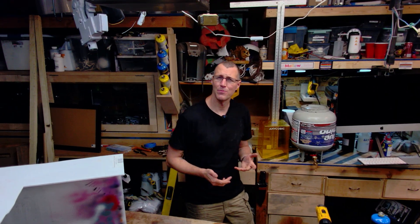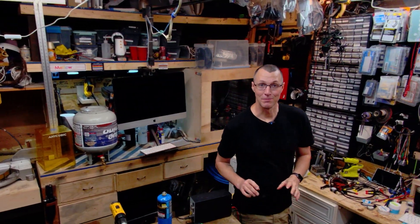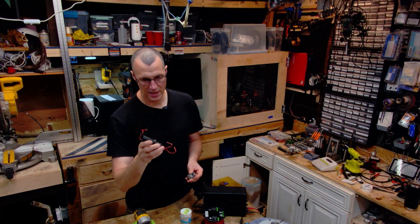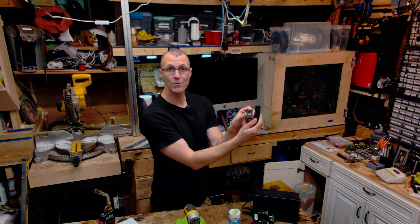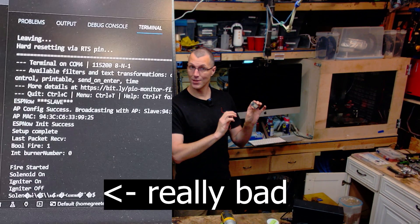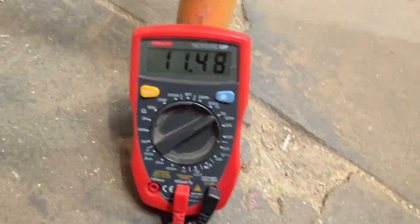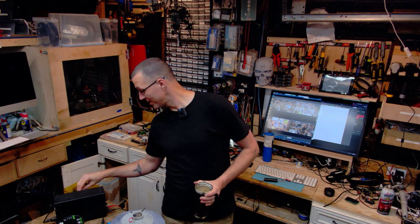Five weeks later, it looked like I was making great progress, but I ran into a huge slew of problems. I ordered 25 of these arc generators and only need six working ones — that's how many I've replaced. When the arc generator fires right next to the chip, the chip dies but keeps running, and there's burning propane shooting into the air for a malfunctioning chip. My general poor understanding of electricity has been really problematic. I used really thin wires to run to things that require up to four amps — they were undervolted the entire time. Then I'd set a bunch off at once, pulling eight to twelve amps, which makes the igniters get upset and stop working.